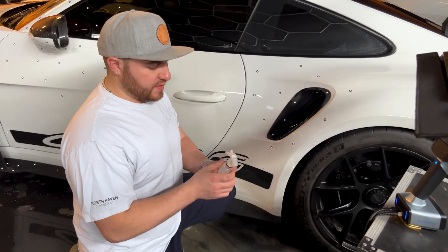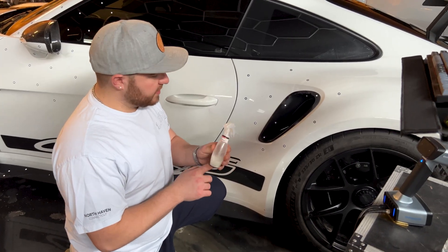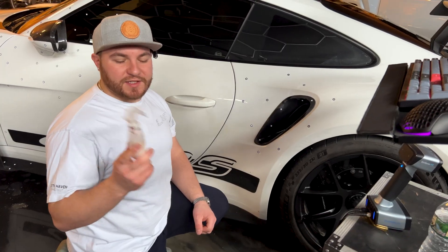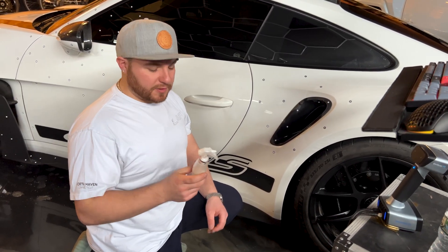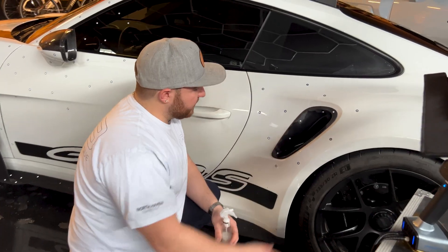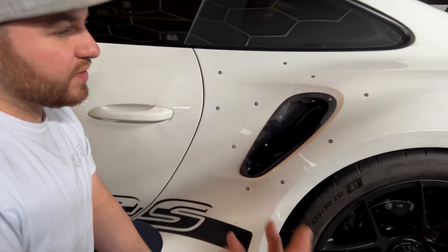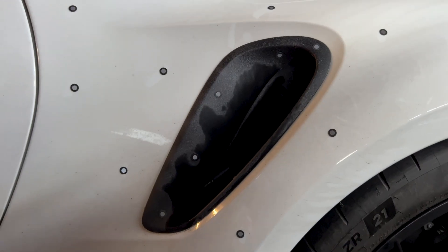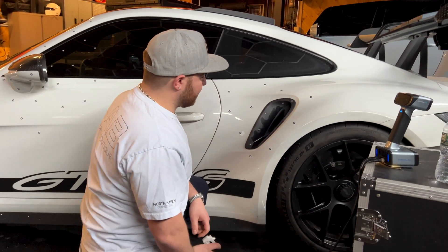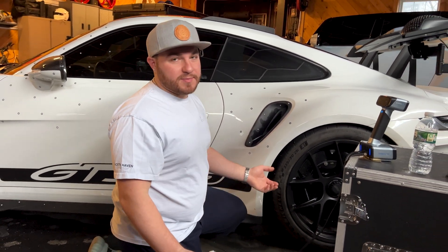For those who haven't seen the Corvette video, this is our little mixture — courtesy of Function Fabrication Austin. He told me to mix isopropyl alcohol and baby powder to get a nice satin white finish so the lasers can get picked up. The reason for the isopropyl is that it evaporates fast, leaving just the baby powder behind. Easy cleanup and it smells good.